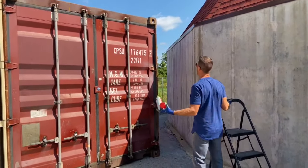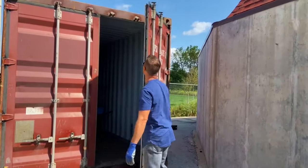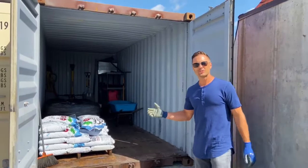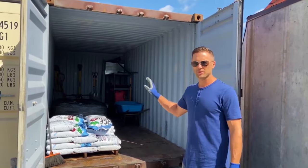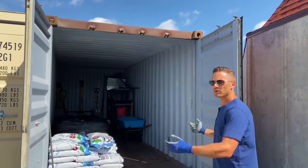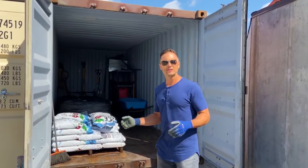It's going to make these doors open a lot nicer — a lot simpler. Everything moves a lot easier just from one application. It's good to do periodic maintenance on the container, specifically the doors. Fluid filming all the joints, open them up, close them a couple times, get everything moving. That's going to make sure your container lasts a long time.